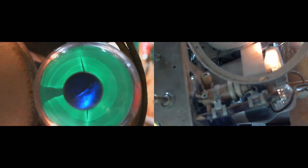Okay, so I got pretty excited about finding a coil that reacted. Now, the first mistake would be to not continue checking other coils, because I got too excited. So, now more coils. Well, those would be the IF coils. They could be implicated in this. So what I'll do is I'll just try to disturb those a little bit.